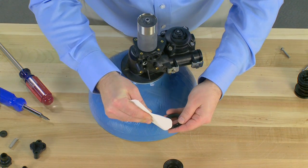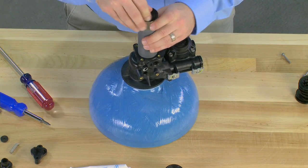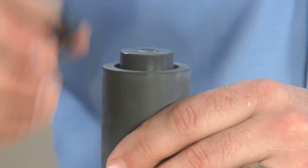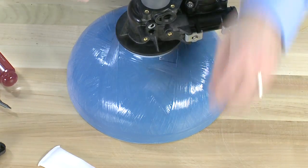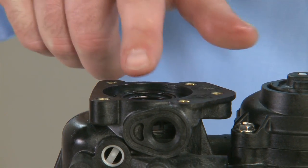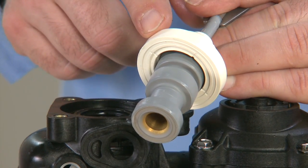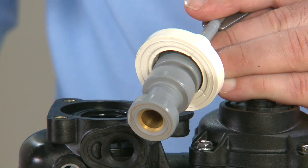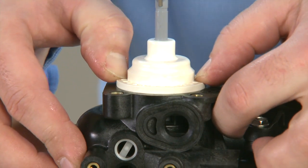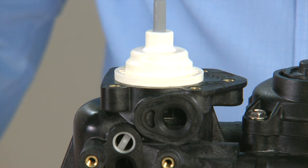For the remainder of the seals and spacers, we continue the process to add lubricant to the seals and add them into the body using the tool to help guide them in. Once we have all of our seals and spacers in, it should sit below the edge about an eighth of an inch. This gives room for our top cap to come in and compress all of our seals and spacers tightly. We press the piston down straight into the center, noting that the cap will be up about a sixteenth of an inch from the body. This will compress when the top plate is reinstalled.